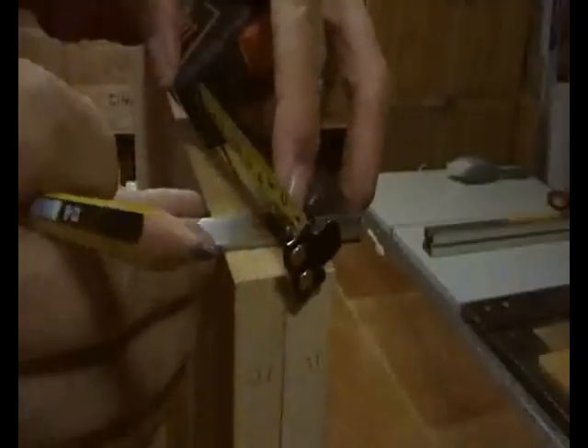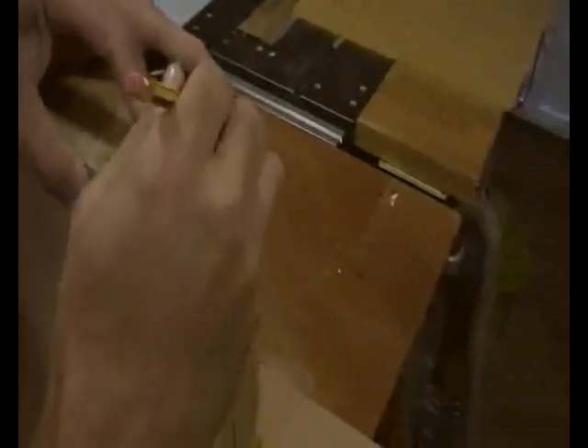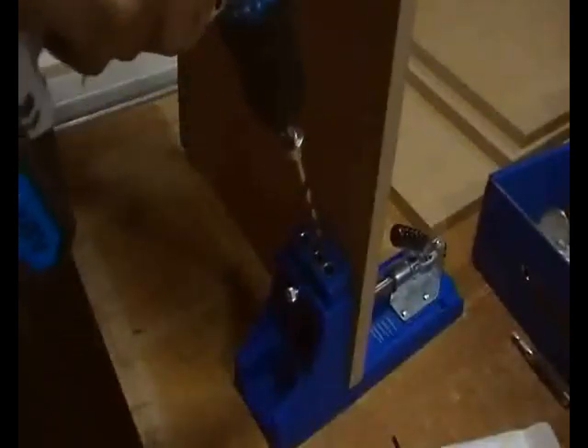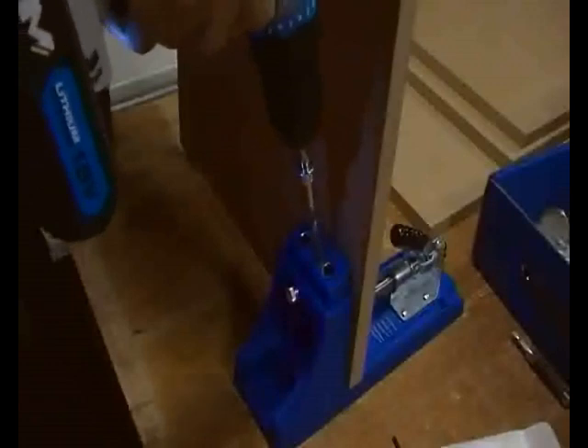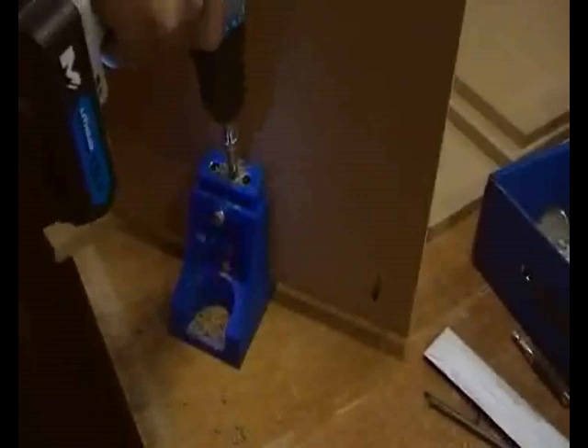These different size squares are really useful — I use them a lot. I decided to use pocket screws with straightforward butt joints. The MDF was from a purchase a couple of years ago and was still the old type and strong enough to cope with the screws, with only a bit of blowout where I'd set the depth too far, but that was my fault.